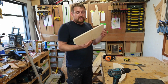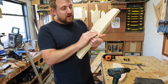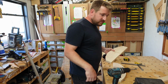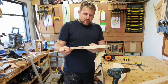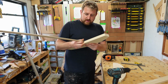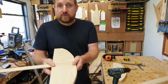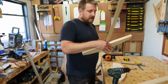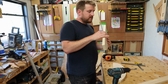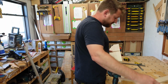Right, before I start carving the sides of these, I'm trying to do the joinery, inverted commas. So I've got my grooves in for what will be the bent handle. It's not going to sit perfectly flush, but it's not bad. Not bad at all. So that'll be glued in there. I don't know if I'll pin it or just let the glue do its thing. It'll be pushing outwards anyway.